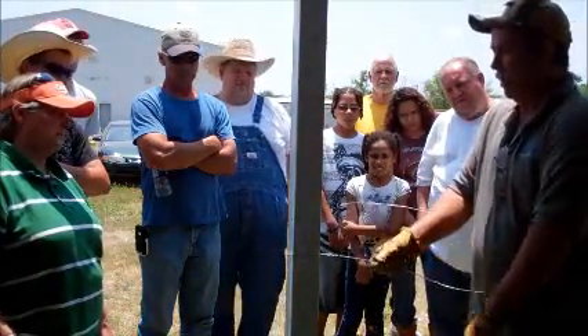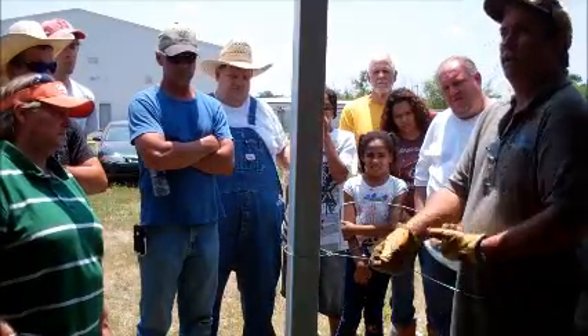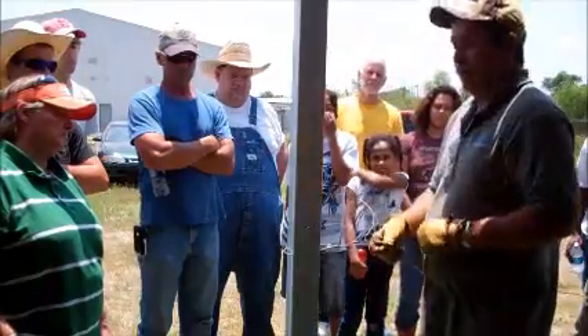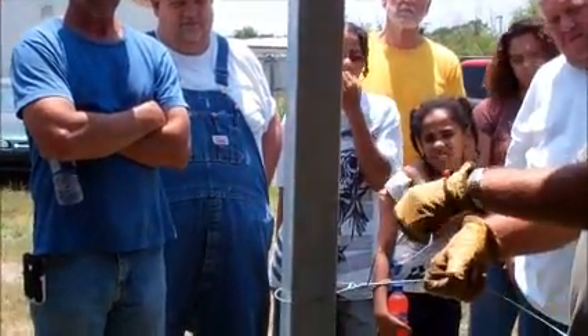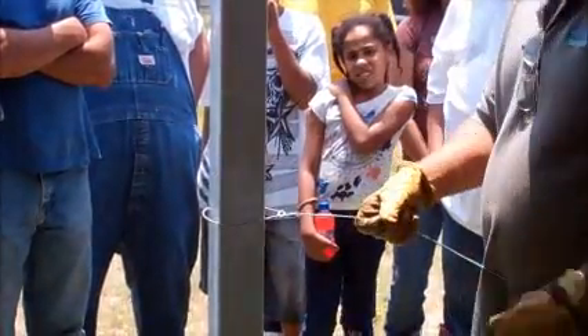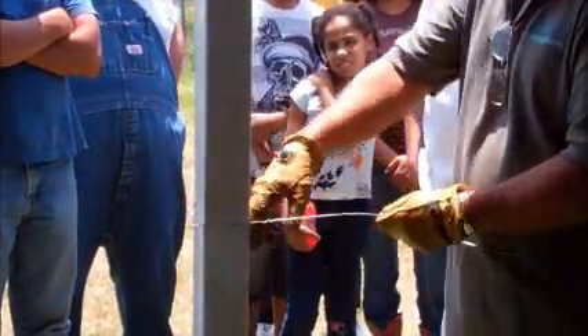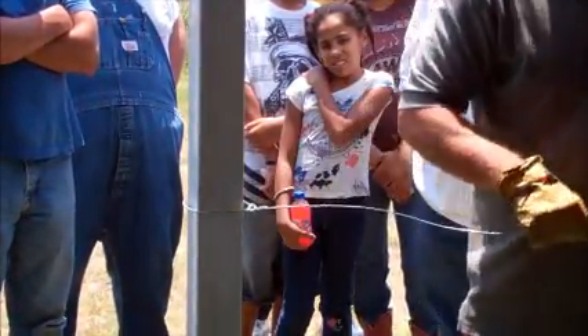When you get to the top and you think you've got three or four wraps there, you take your handle — it's parallel to your pull wire where you're wrapping. To break it off, you turn it opposite, crossways of your turn wire. Turn it a half a turn and it will pop off in your hand. It's easy to do. That thing will slide right up real easy.